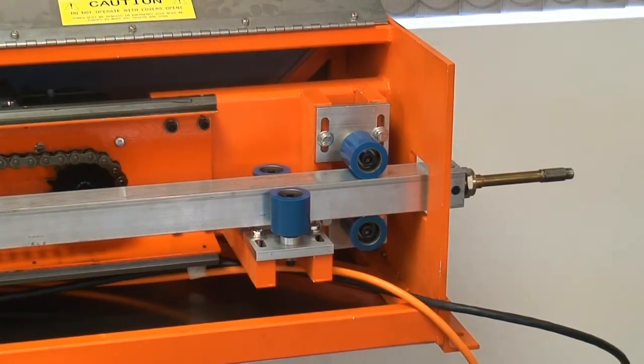One of the nice features about these rollers and this particular design is that a small round lance could be used for smaller diameter pieces, or the same type of reciprocator could be used without the rollers and without a lance, using a downward pointing spray gun mount for downward applications. The nice thing about this design is it uses our traditional steel roller and track and chain design, but puts it into a modular enclosure that can have the guide rollers for a lance and has the nice covers that are easy to open yet provide secure coverage.